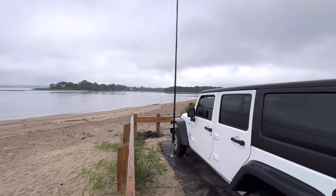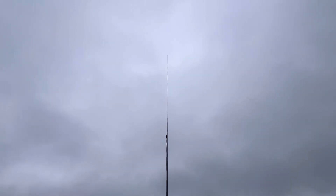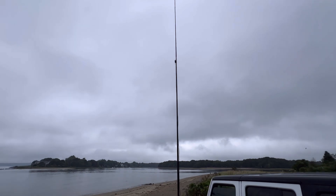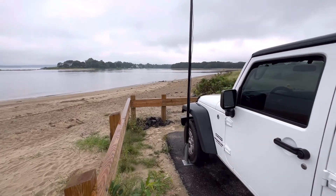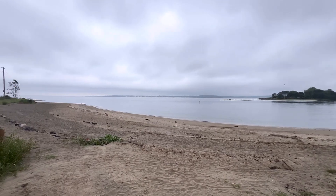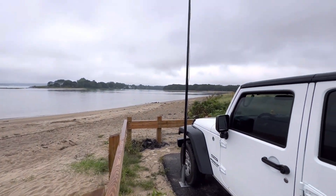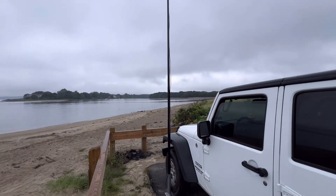So here's the antenna. That is my DX Commander 10-meter expedition pole. At the top is a 16-gauge speaker wire cut to half wavelength for the 10-meter band. That's a 64-to-1 unun. I have 50 feet of coax going down on the ground and around to go inside the Jeep, no counterpoise. This is Oakland Beach in Warwick, Rhode Island - that's Greenwich Bay, which leads out to Narragansett Bay. More details if you're really interested in this antenna - I'll put a link below. But this video is about this radio. Let's get in and play.